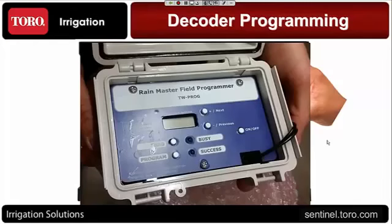Push the program button, and then when it reprograms it, you get the light next to success that lights up and indicates it. If I want to verify it and make sure that I've set it to that particular decoder address, I can just hit the read button again. It should come back and say 005.